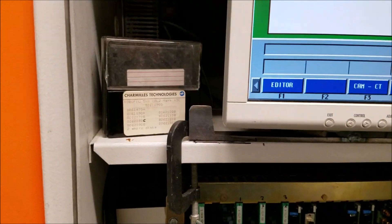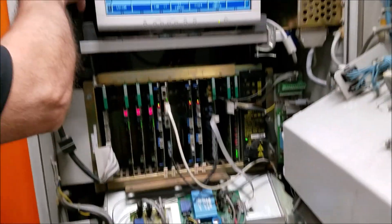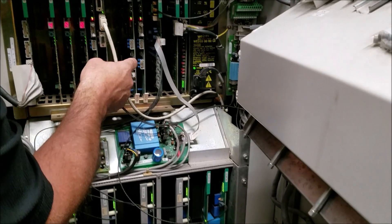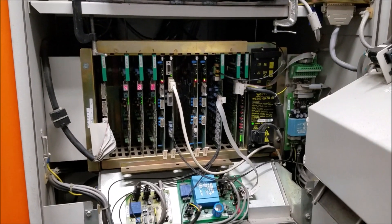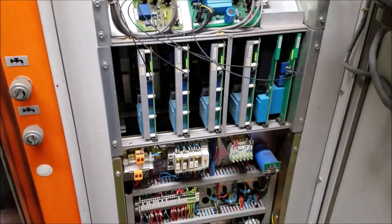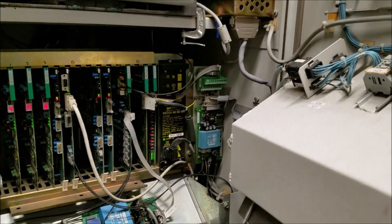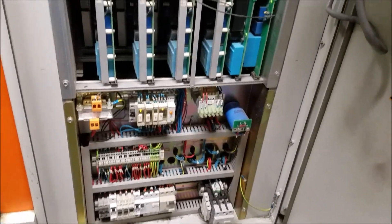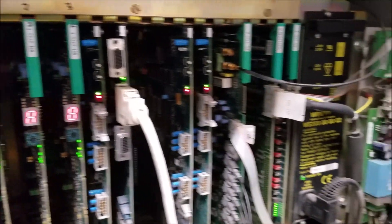We have all the stock backed up — all the virtual manuals and originals. If you had to wipe out the memory completely, these floppies will restore everything. We did replace the batteries once — there are four or five NiCads in there that are known for leaking. About 10 years ago we spotted a little leaky one, so we bought new batteries and I soldered them all in. If you're good at soldering you can do it that way. Nothing really major has ever gone wrong down here, but they have you go to each measurable point and check it — nothing major has ever come up.